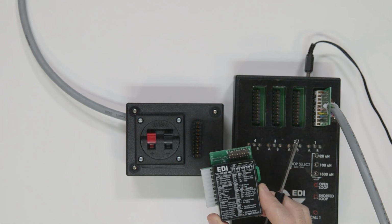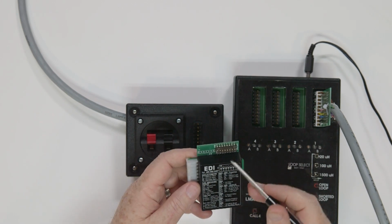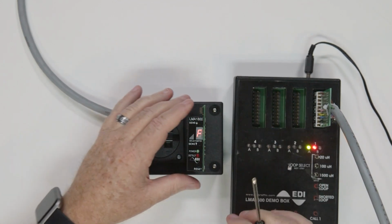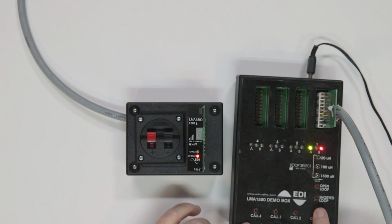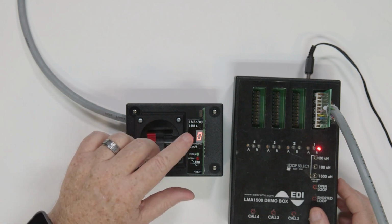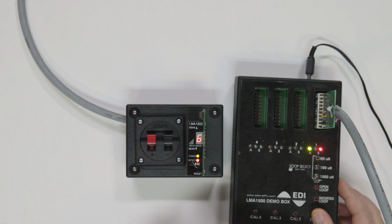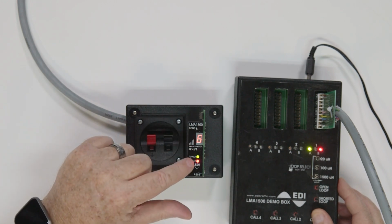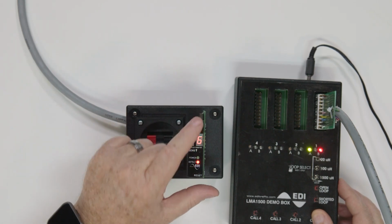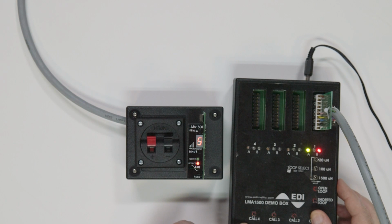The deflectometer makes it quick and easy to set the sensitivity of the detector. Place a typical mid-size car or small pickup over a properly installed loop. You want to see a value of 5 displayed on the deflectometer, and the detect output LED should be red. This is an optimum sensitivity setting. If the typical vehicle is completely in the detection zone, the detect LED is on and the display is not 5, you will need to adjust it. To adjust, push the up or down button on the front panel of the detector until the deflectometer displays the value of 5.